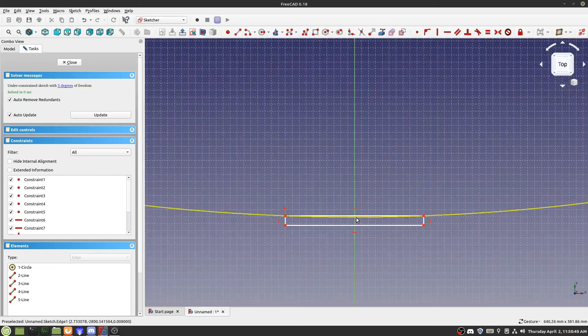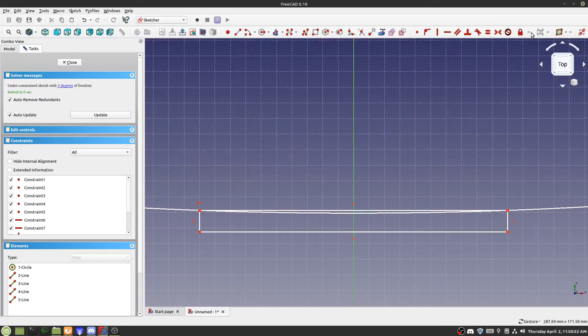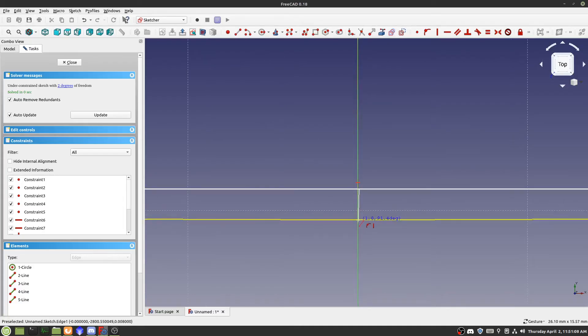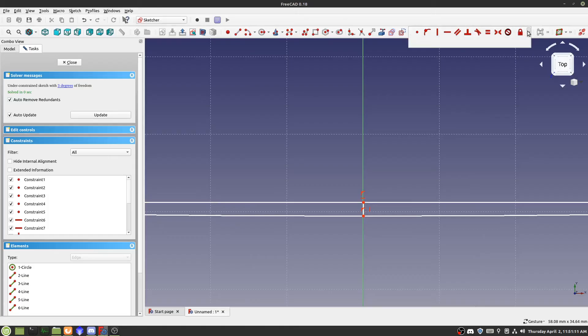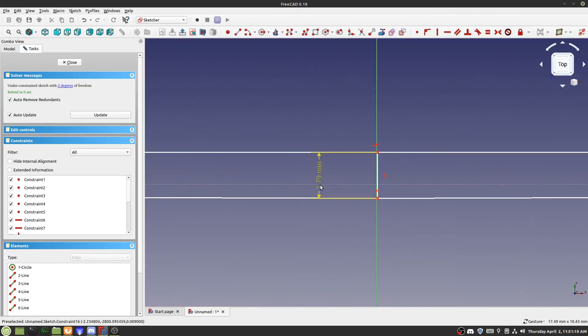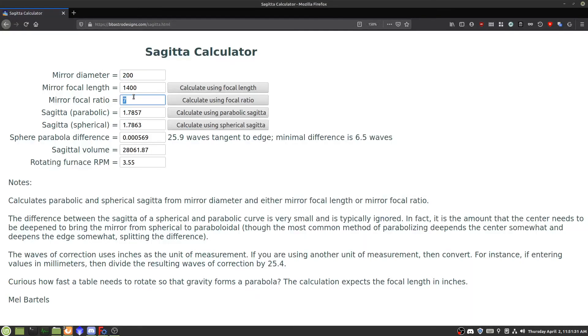The mirror does indeed have a curve in it, but this has to be a specific depth depending on what type of mirror we want. If we think back to the sphere example, our focal length is half the radius of curvature. Drawing that and intersecting it with, in our example, a 20cm disc, we find how much glass we need to remove — in this case 1.8mm. That's what I've done with my tool: removed just about 1.8mm of glass from the surface. You can also use an online calculator such as Mel Bartels to find this. Once you have your ideal curve, that concludes our rough grinding stage.